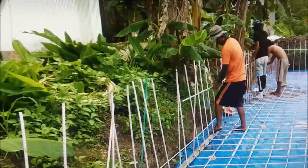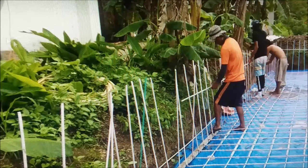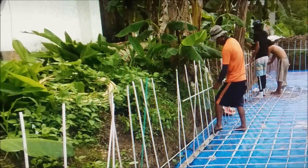There are three guys there, and one here putting an extension cord down for something — I don't know what he's working on or if they'd be using power tools here. That slab on the right — you can see it when the cursor moves — is the slab of the house. The walls are sitting on the slab, so the slab is actually just like a footer — it's about seven inches thick. That way the weight of the wall has to push the entire floor into the ground.